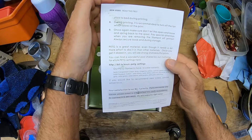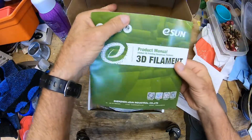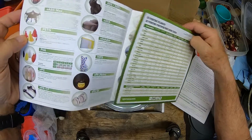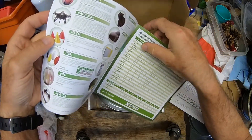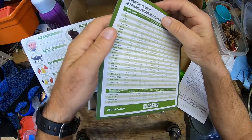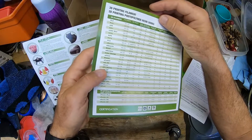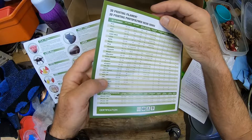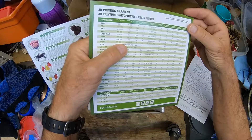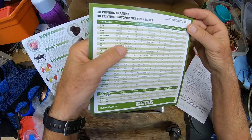Let's look at the spool — there's information about their different types of filament, bed temperatures, and so forth. Looking at PETG on the spool label, it says 230–250°C, which is good. That range includes 237°C, which is the temperature I want to use — the same as all my other PETG prints.